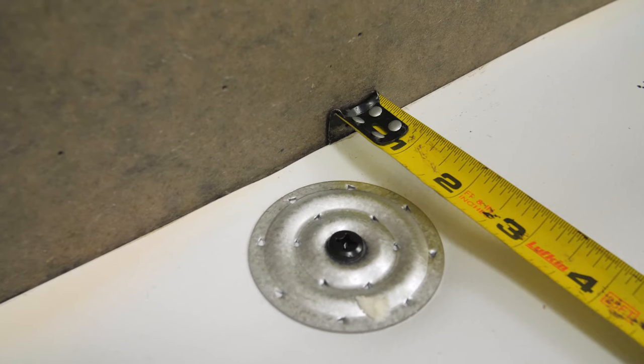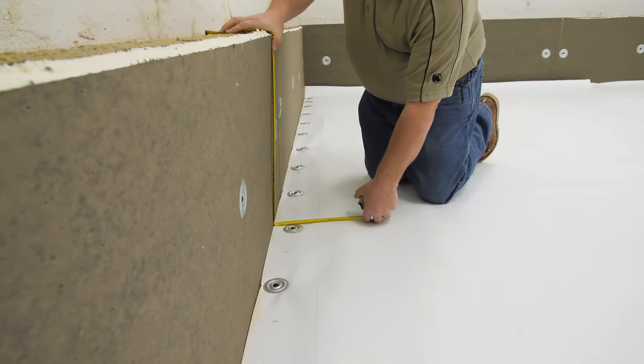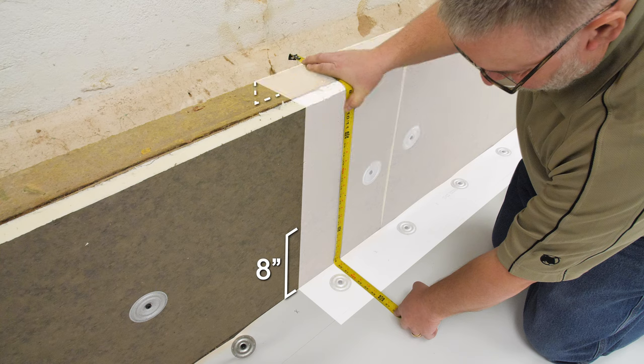Try to keep the plates within half an inch from the wall. Measure the wall at the outermost plate to determine the required flashing height. The flashings must extend a minimum of 8 inches above the roof surface and be terminated, or be long enough to extend over the top and down the face of the parapet.